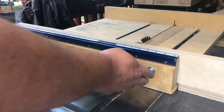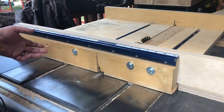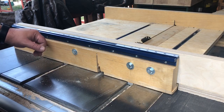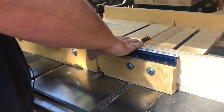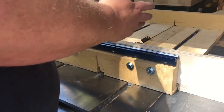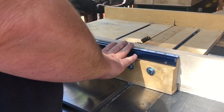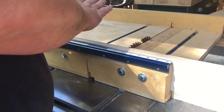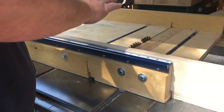This is how I have it attached to the fence. I've got these four bolts here, and I drilled five holes with an insert in there for the fifth hole — I only had four 3-inch bolts, so I'll pick up another bolt next time I'm at Home Depot. The reason I have so many bolts is I wanted to make sure this thing sat tight to the fence because I know this fence is true and straight. That way I can make sure the whole thing is straight, referencing off this fence — which you can verify with the five-cut method to make sure it's square to the blade. With it referencing off this straight fence, every cut from here on will be straight as well.